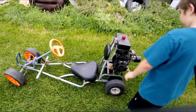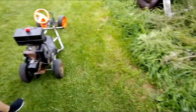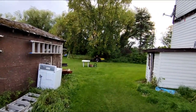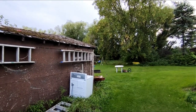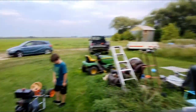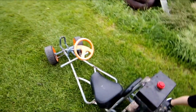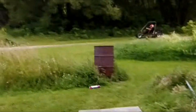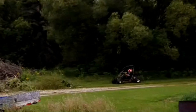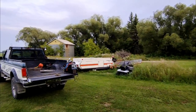It's a go-kart we made — it goes, but that setup is a little more suited for adults. I think I'm going to gear it up a little more. Instead of a 60-tooth it'll be like a 30 or something — then you get the speed and torque balance.